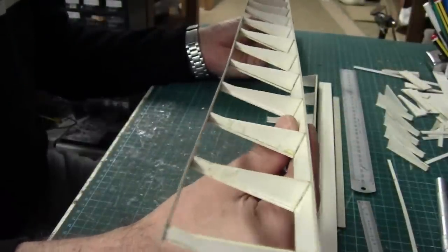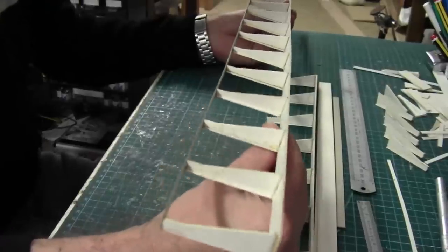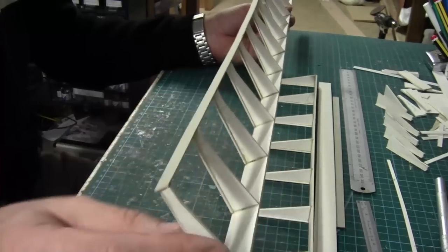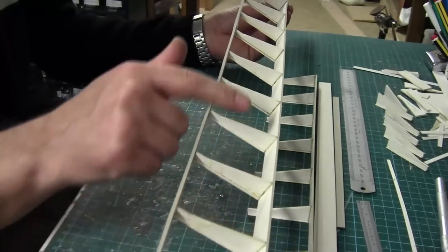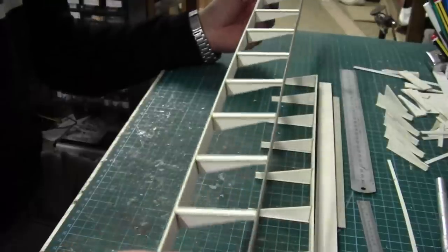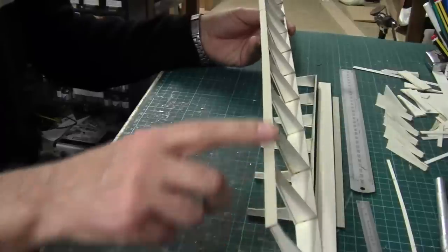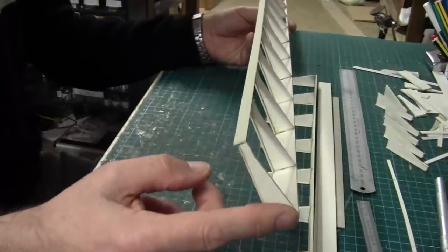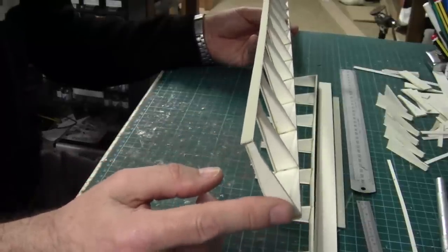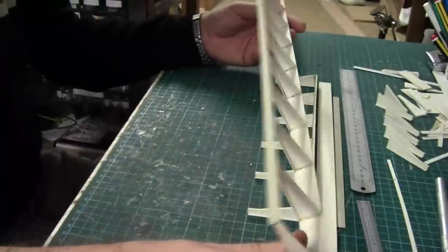Right, so moving on a little bit, as you can see, we've got the first of the canopy frameworks together. There we've got the back support on and the front support on. This is just to tie in all these supports. It's hanging down a little bit on the inside, by 3 millimeters. So this will be the supporting fascia, as it works, because we've still got the fascia to go on this, if you like. So that's just, like I said, to tie it all in.